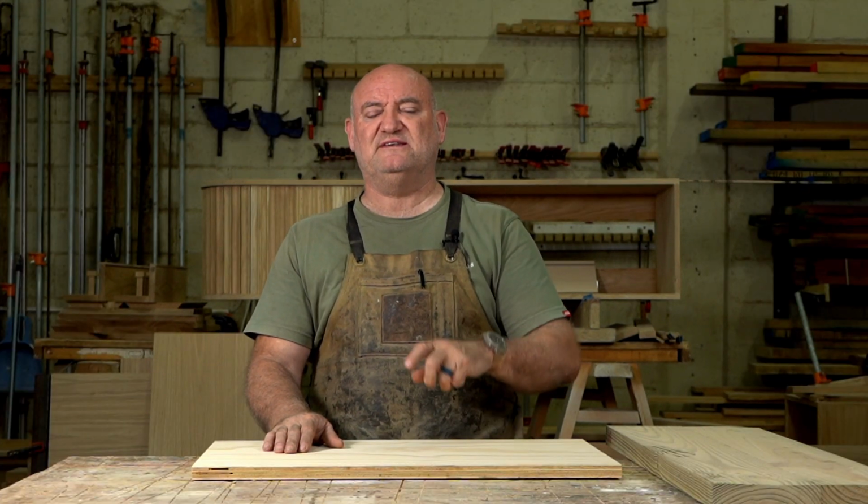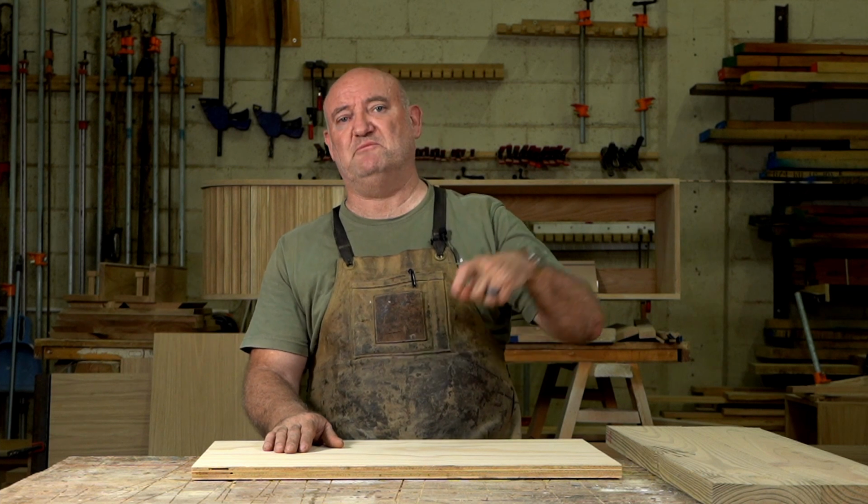Is pine ply any good? Well, that's kind of like one of those questions where it's like, how long is a piece of string? Any good for what is the real question. Each plywood, and it doesn't matter if you're talking about the most expensive plywood you can buy or the cheapest plywood you can buy, if it's used for the right purpose, it's not just good, it's perfect.